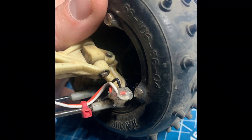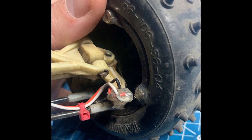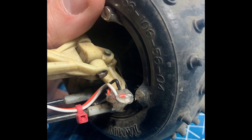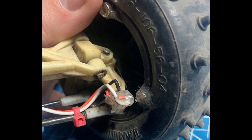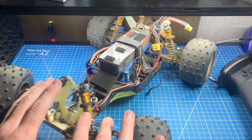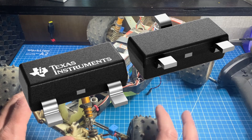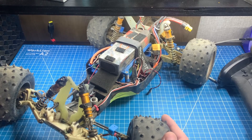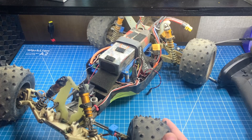The next issue was managing the distance between the hall sensors and the magnets. Because I had to mount the hall sensors to the RC car suspension, they would move around a small amount relative to the magnet, which caused the A3144 hall sensor to either create false pulses or be out of range of the magnets. So I switched to a much newer DRV5015, a tiny surface mount hall sensor meant for high speed motor commutation. It's about 10 times more sensitive to magnetic fields, it's a latching type sensor, and less prone to false triggering.